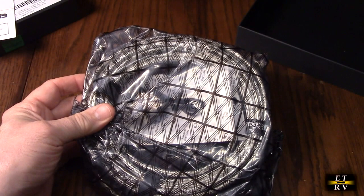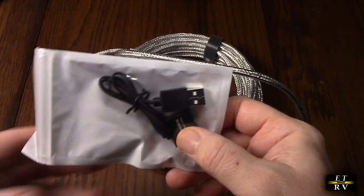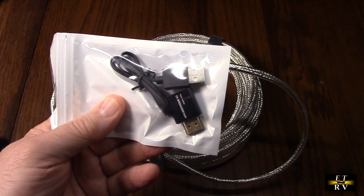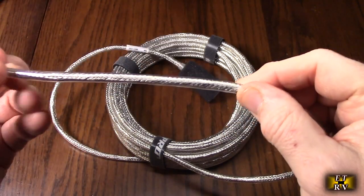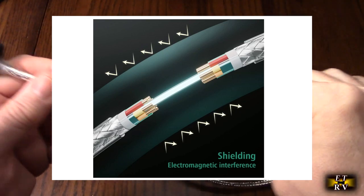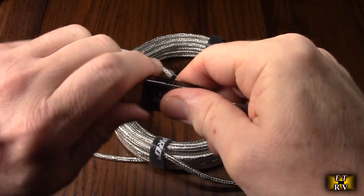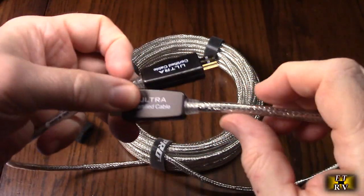It's packaged in a nice box. Out of the box you can see the included USB-A adapter — you plug that into a USB-A port and connect it to either the transmit or receive side to provide additional 5V if needed, though most of the time you won't need it. The cable is transparent so you can actually see the ground shield, which is really important to prevent EMI and EMF interference in both directions. They have foam and individual protectors on each end. It feels really nice — really nice quality with great strain relief.